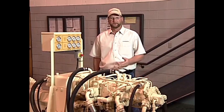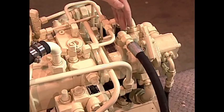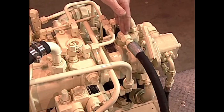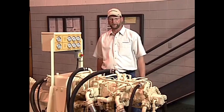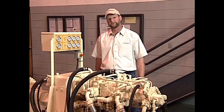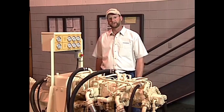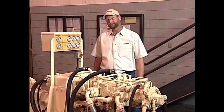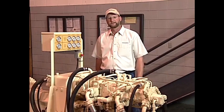Coupling these two main pumps that run the drive cylinders, we add the accumulator pump. This hydraulic pump operates the S-tube, timing the S-tube and drive cylinders perfectly for smooth pumping performance. Our ability to do this with an electrical signal minimizes the amount of time it takes to change stroke, which also helps with boom bounce and production speed.